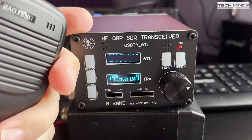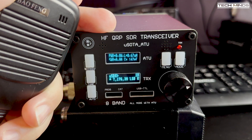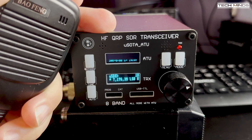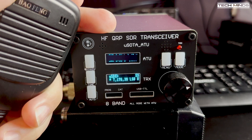Receiving appears to work, but there's that little whooshing sound at the start of some of the transmissions. I think this can slightly be rectified by adjusting the attenuator, noise reduction, and even some of the AGC settings. It's almost as if the AGC was far too slow to react to the strong stations on 40 metres, but I did manage to improve it slightly.